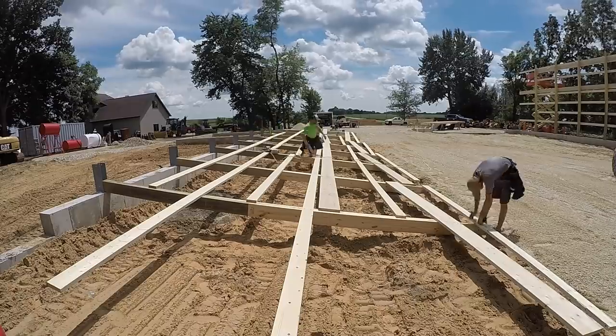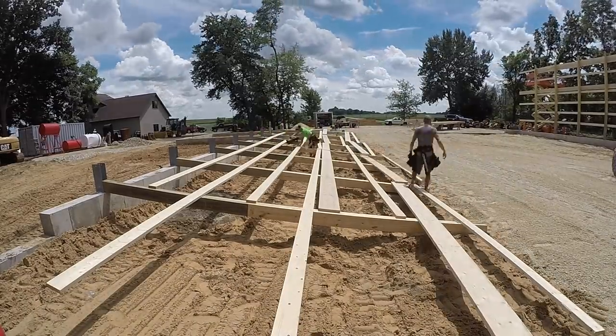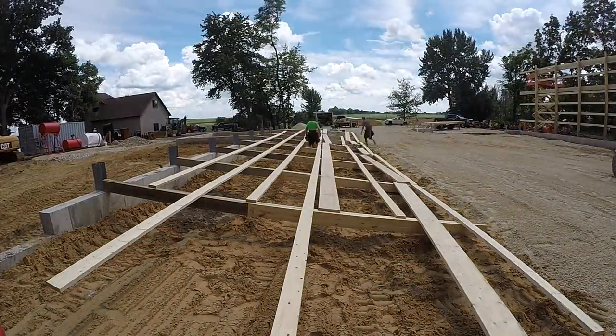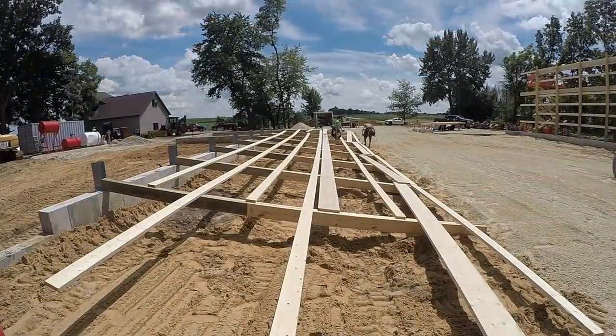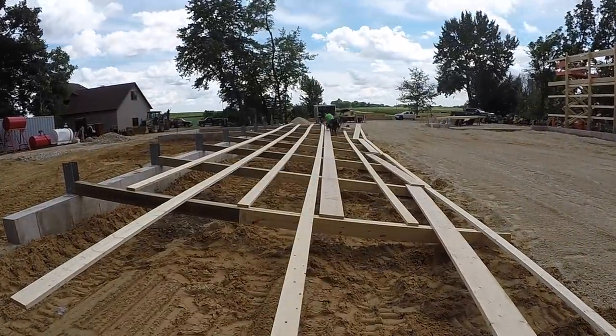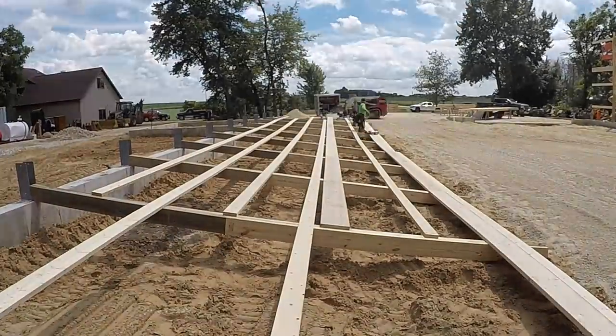So one thing that I was going to talk about was the jumbo nailer. So this process, we used to all, three of us, however many guys were on site, all take a post and work the wall girts up one at a time, swinging two 20-penny ring shank galvanized nails into each connection. And that was a lot of work.